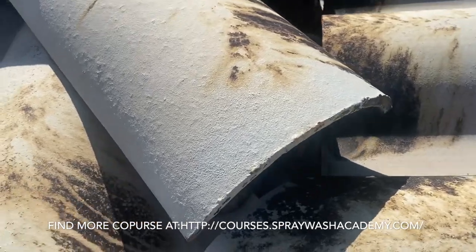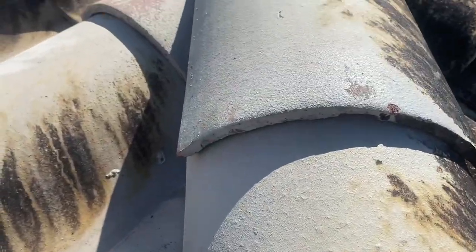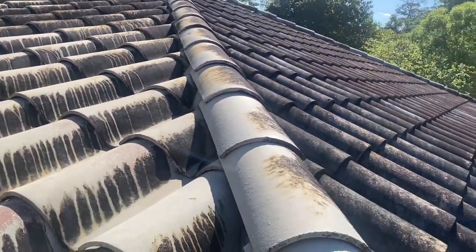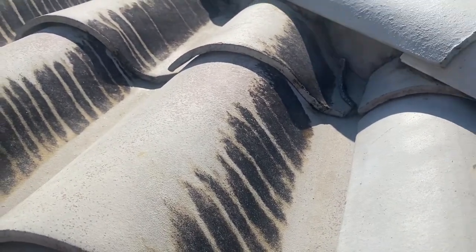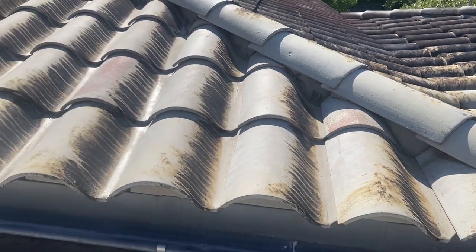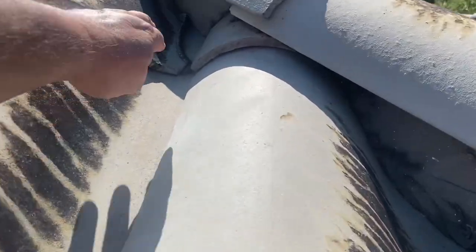The caps are typically a bit different. They don't have the little tab coming out on there — they're just shooting straight up. You'll have those on the hip ends and then across the top. Here's an idea of some of the grout that's holding these in; it's just a concrete product — they're stuck in under that. Most of the time these tiles will actually have an underlayment on it, so the tiles aren't necessarily keeping the waterproofing out. There's either a membrane or metal. I've also seen roll roofing right here, which is probably the underlayment under this barrel tile.